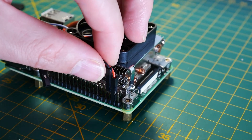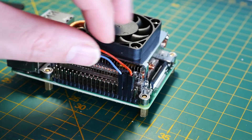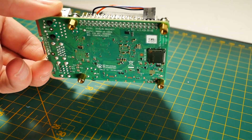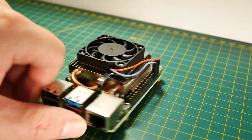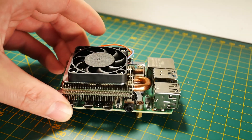The installation has changed too — the inserts are now attached to the frame of the heatsink, so installation is much easier: you just need four screws and it's on straight away. In terms of obstruction, you will be sacrificing some space, so you won't be able to use any Raspberry Pi hats. However, if you extend the GPIO and extend the POE header, then in theory you could run a Raspberry Pi hat on standoffs.